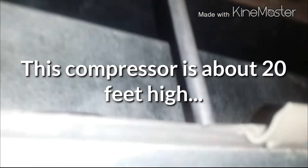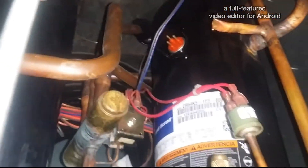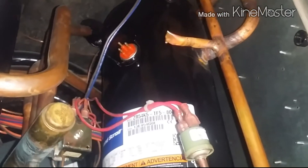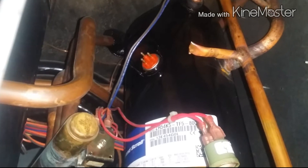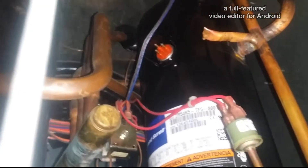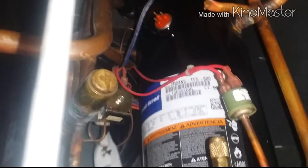It's gonna be a difficult one, guys — it's not gonna be easy. That's the guy we need to swap out. I came on a service call; this thing was running for about 10 minutes and tripping the breaker. Took some readings — the amperage just kept building up and cutting the breaker. Once I isolated it, it's been running ever since. So this is the bad boy we gotta replace.